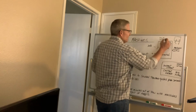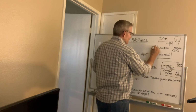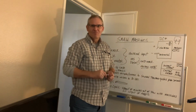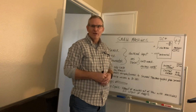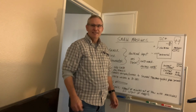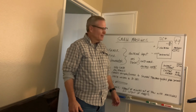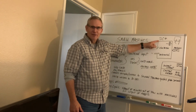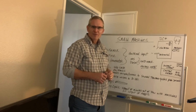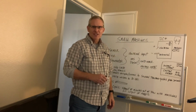Now, that being said, let me tell you that in my coming up on 40 years of being in the welding industry, folks, it's been over 99% of the time that my welding has been on DC plus polarity, because I'm trying to get the best penetration I can as I'm doing the welding. So this is a polarity that's used quite a bit in the welding industry.